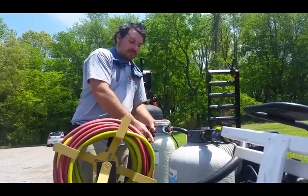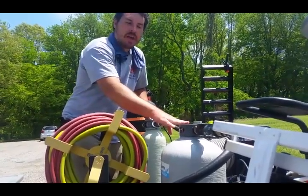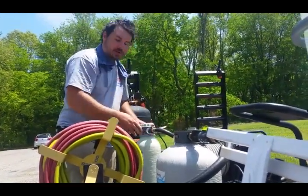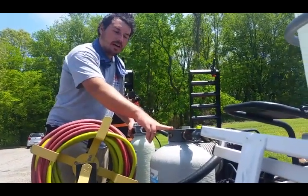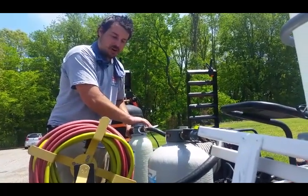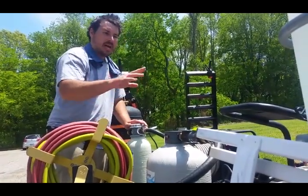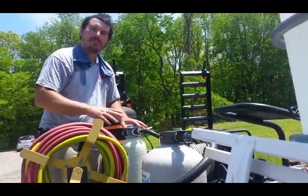I've made a video about the water softener that I have. I run it through my water softener first, which removes all the hard minerals out of the water. Then I run it through my deionization tank. The reason I do that is because if you run it through the water softener first, it'll make this DI resin last longer. You don't have to do that. You can buy just the deionization tank by itself and just run your water through it and then to your pressure washer or whatever.